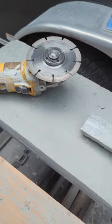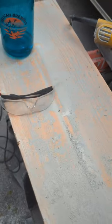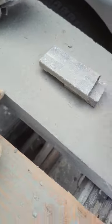If you were wondering how I cut these stones, I just have a four and a half inch diamond blade on an angle grinder. It is crazy dusty — you have to make sure you wear eye protection and a dust mask. You get covered in dust, but it makes pretty quick work of this aggregate.